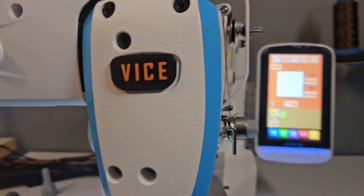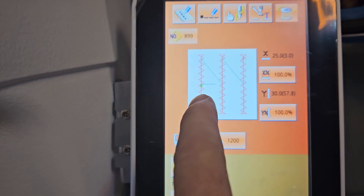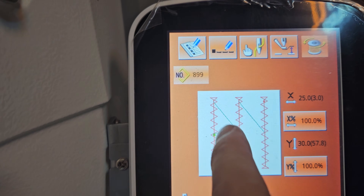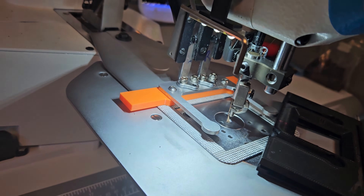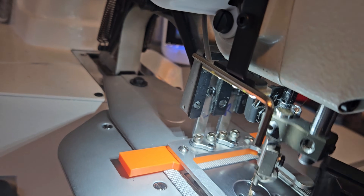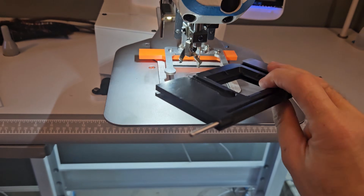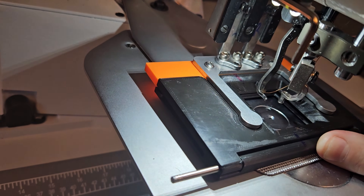This was my personal touch. You can program it — this is the program I have right now for stitching. I wrote this program just like my CNC machines, but it's stitching. You have to tell each stitch where to land and plot that out. It's like old school programming on a notebook. And one of the coolest things — I had to design all this fixturing. This thing on here is definitely not stock — it's a 3D printed fixture, still kind of a rough draft. It will go in there, you smash the foot pedal, it clamps down, and you start to sew. This thing is wicked fast.